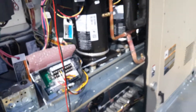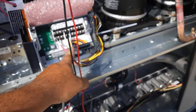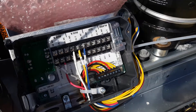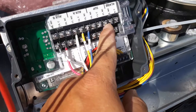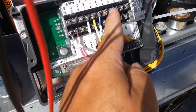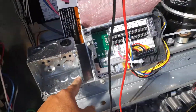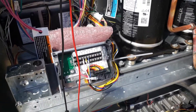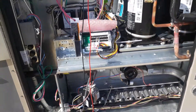What I'll do is come over with a wire off my module and come into there. I'll land one side to the alarm contact, then do a jumper from the normally open over to the normally closed side — a little jumper right there. Then I'll come off with one leg of my resistor, go to the common, and wire nut into the other leg that's feeding over to the module. So that gives me supervisory and it can short out and still give me alarm. If that doesn't make sense, please comment and I'll do a video on wiring it up.